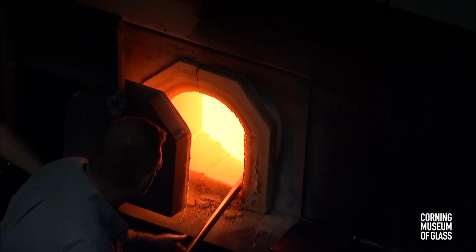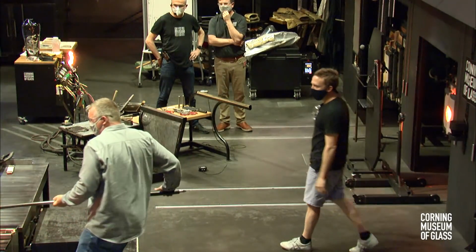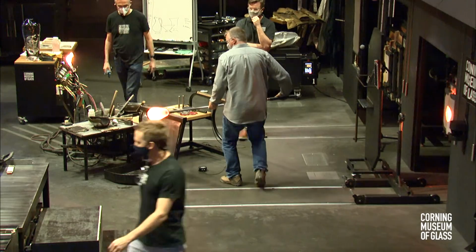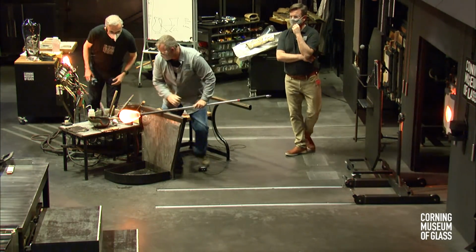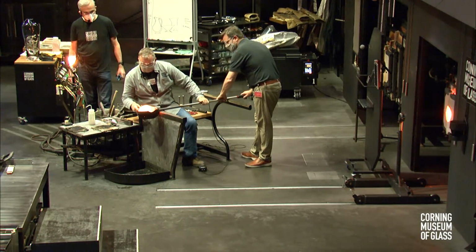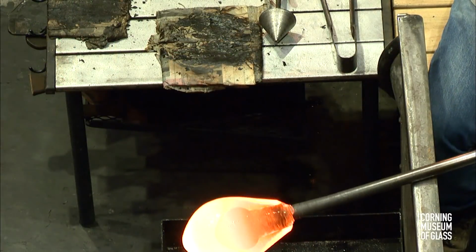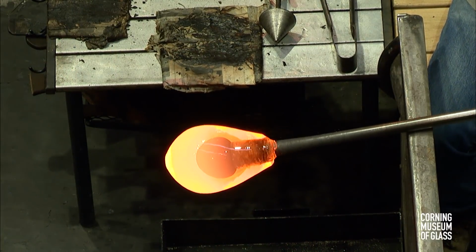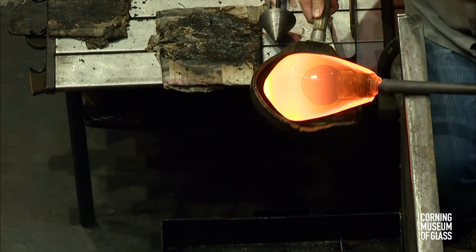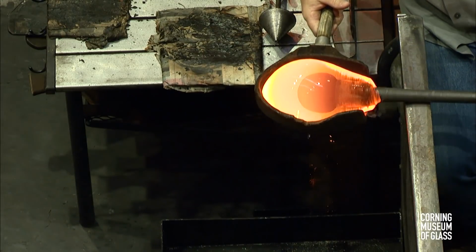The glass itself, what we're working with is called soda lime. It's a pretty common type. The main ingredient is silica sand. Soda ash and limestone are the other two main parts, but silica sand is the base ingredient for any glass out there. And the different colors are formed by melting in different metal oxides or metallic chlorides. The bar that I showed you, we purchased as pre-made from a company over in Germany. There's some pretty big color companies that produce color like that. We buy from the Reichenbach factory. They've been making colors for about 200 years.